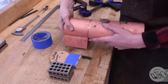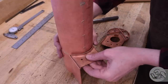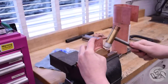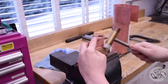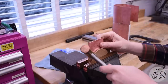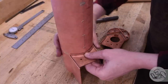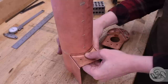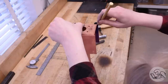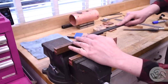I'm going to test fit all the pieces together now. This step is really important, and I should have been a little more careful. Got the outer crown sheet on the shell, and I fit the throat plate in there. I decided I didn't like the look of that throat plate joint — it's not as good as I previously thought. So I did some more hammer forming, again using the tube sheet backer which has the same diameter this throat plate requires, and I annealed that throat plate again and did a bunch more forming on it to try to tighten up the clearances. Next, I have to trim the outer crown sheet to length — it's made intentionally oversized so that you can trim it after the fact. So I marked on the throat plate and the back head where it needs to be trimmed.